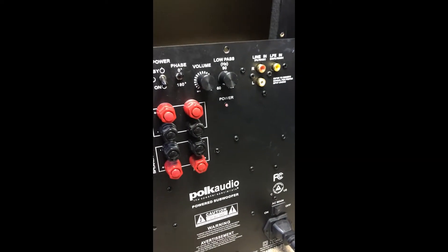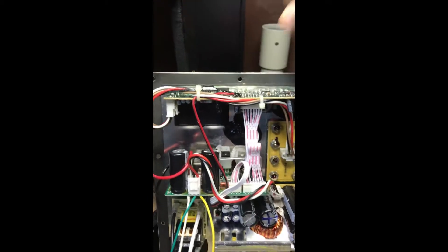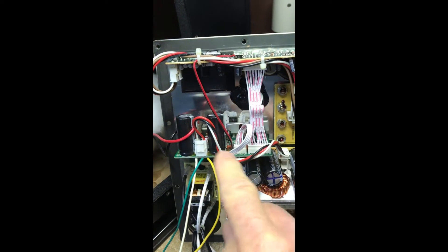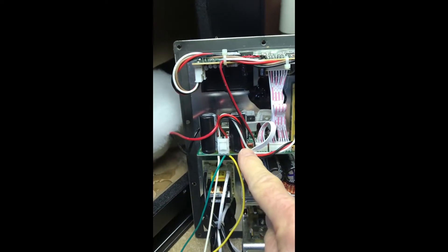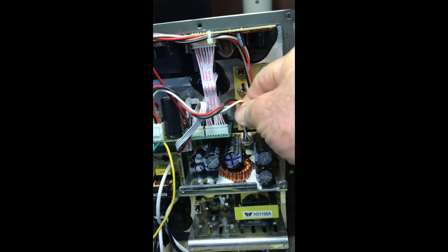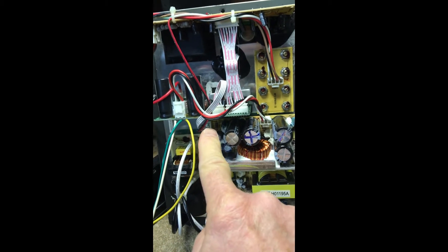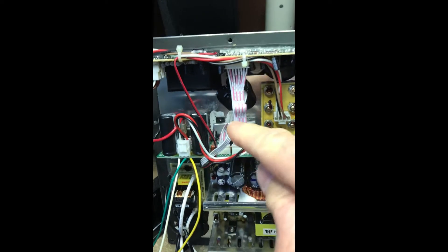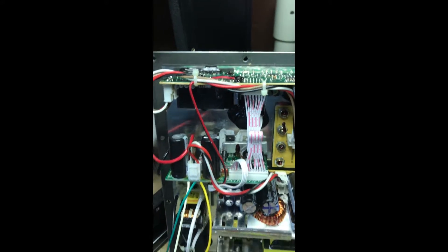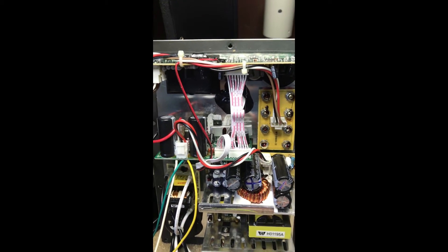So that's what it sounds like. If we turn the amp board around, it's divided into three sections: the top board is the input and volume control — mainly a preamp; the middle board is the audio amplifier itself connected to the speaker; and the bottom is a large power supply that supplies plus and minus 57 volts to the amplifier, with a smaller plus and minus 15 volts for the preamp and smaller components.